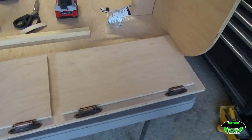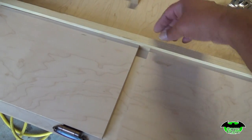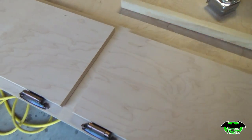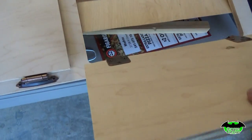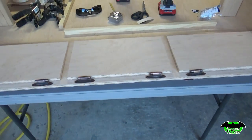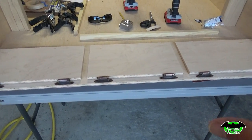Just a real quick shot of the hinges — they are now installed, and that went relatively easy. I just put a little batten up here, clamped it down, made sure my cabinet was flush with the top, and then fastened my screws down. That kept everything from moving, and everything looks to be evenly spaced. I've got an inch and a quarter on the edges. Now we'll dry fit it — we'll set it back there, see what it looks like, and then we'll take these off, get everything banded, start varnishing up, and then we can put it all back together and call it good.